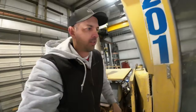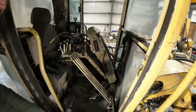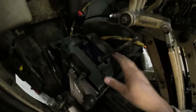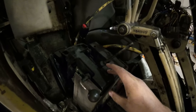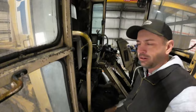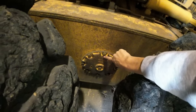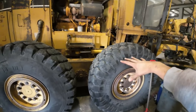One major concern is that the transmission control housing was pillaged for parts. These machines use an air solenoid setup to shift the transmission, and with it taken apart we don't know what gear it's in. We don't want it driving through the shop wall, so we're going to pull the axle shafts out — that way if it starts in gear, it stays right here.